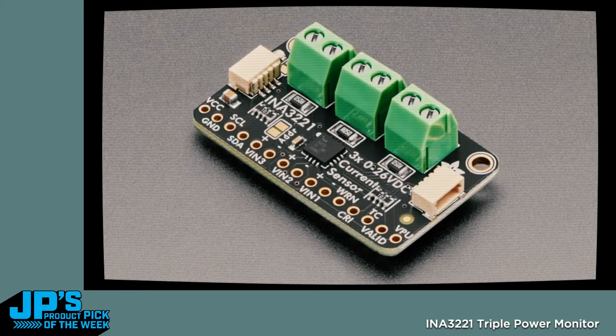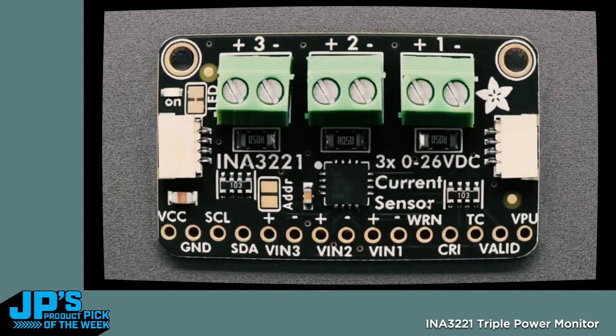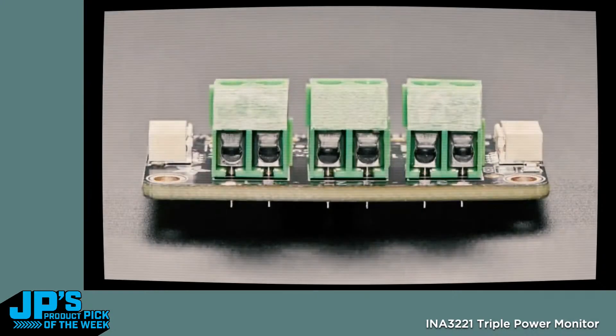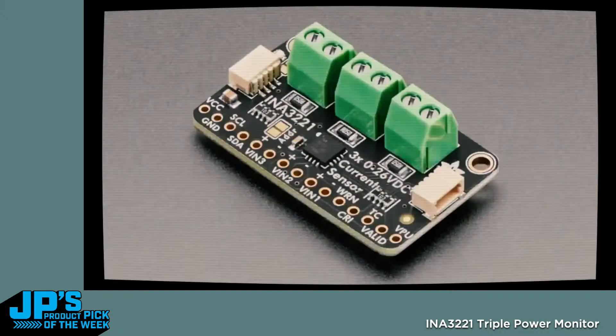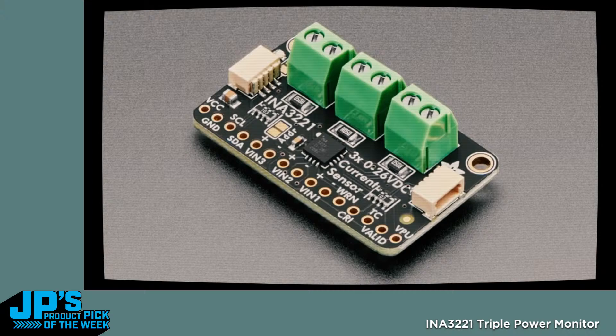Basically, it's great if you are measuring multiple voltages and currents — photovoltaic projects, battery charging, motor control — and you want to do very fast power measurements. The INA3221 is great. One thing: it doesn't have a FIFO and it doesn't do power summation; I think the INA228 does that, so this is a simpler one. It's really a lot like the INA219, very similar, but just three of them. I'm using this for a project where I had to measure 12-volt, 5-volt, and 3-volt power supplies all at the same time. I thought it would be handy to make a breakout board — no soldering is required. You just use the terminal blocks and Stemma QT for I2C and you're ready to go.